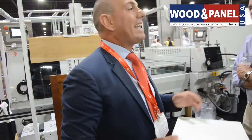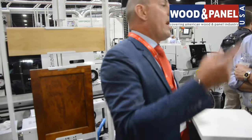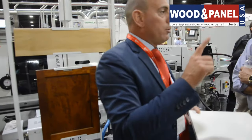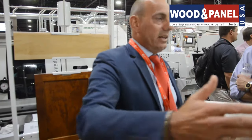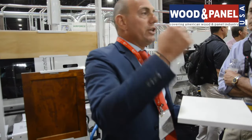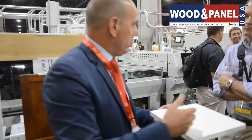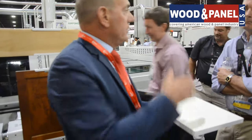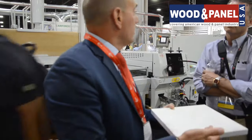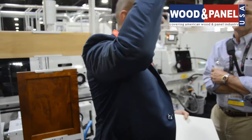I apply my base coat and I can apply it in one shot — 60, 70, 80 grams, even 100 or 110 grams — because if I'm on the traditional way, applying roller by roller, I'm not able to apply so much material. My surface would be a disaster, so I have to sand most of it to create a smooth surface. The traditional way to build up a high-gloss panel would be: primer or adhesion promoter, then base coat one, gel, base coat two, gel, base coat three, intermediate sanding, and then top coat. Or: base coat, gel, base coat, sand, third round of base coating, sand again, and top coat — if I really want top quality.